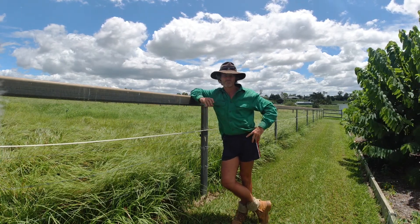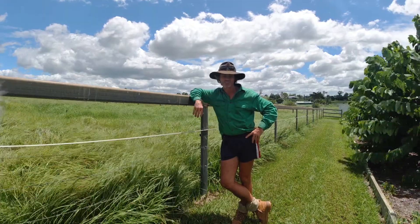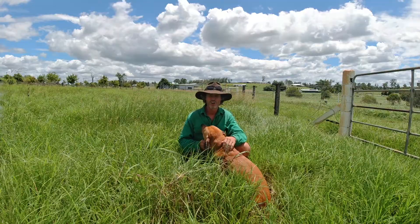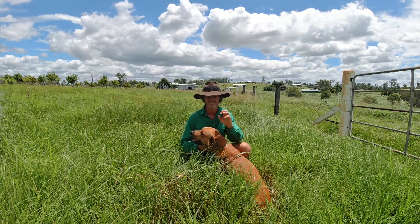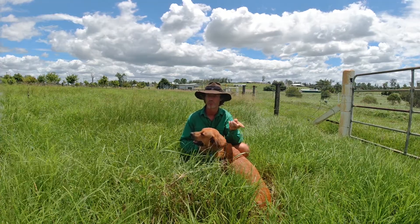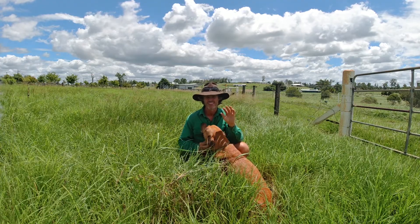So the first thing I'm going to do is spend some time and go through the paddock to see if I can find where it's shorting out. I've walked around the whole paddock to check — it took me roughly an hour and a half to check all the contact points and all the insulators. I had to replace four insulators.